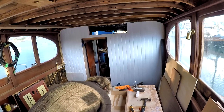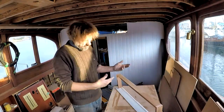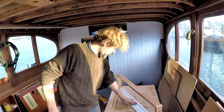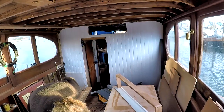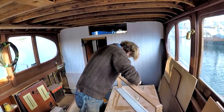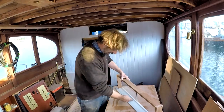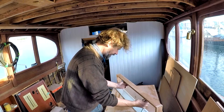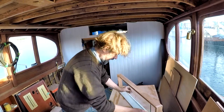Any time now. So pretty much the last thing to do, other than take it all apart and finish it, is to make the stop for the glass. In other words, the fixed piece of glass on the inside goes in here, and it'll be basically permanently bonded in. The sliding piece of glass will be out here. I gotta put it up into the trough up here first. There you go. Good. And it slides back.